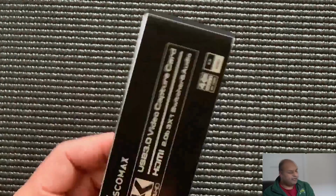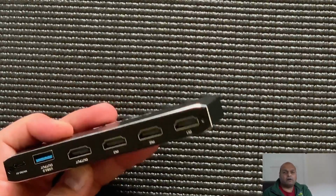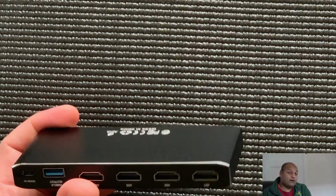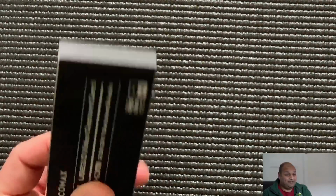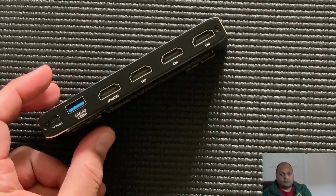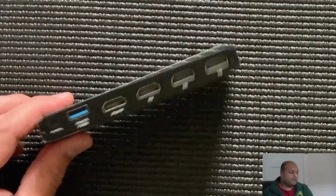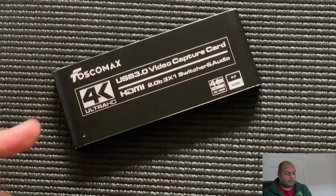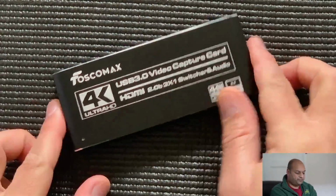I have tested it for almost a couple of cameras connected to it for 3-4 hours, and since you can use only one camera at a time, it's not generating enough heat. And on top of that, as a precaution, I bought some heat sinks, which I just stuck to it, and I think that's going to cut down 10-20 degrees of temperature.